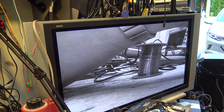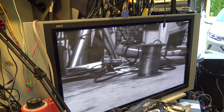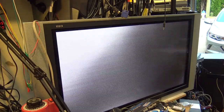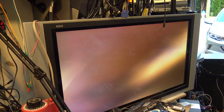And of course it's still producing a black and white picture. At least the zoom lens is working on it. So let's see if we can figure out why this camera is producing a black and white picture instead of color. It's got to be another cap, on this board of all places too. Probably the next cap over, probably this little one over here. Let's just see whether I bridge it, whether color comes back. Well, color's actually come back on it now.